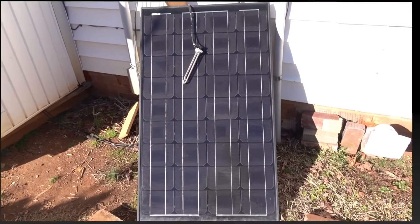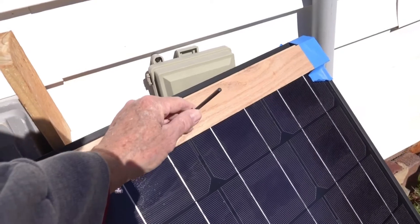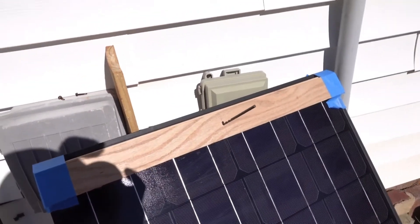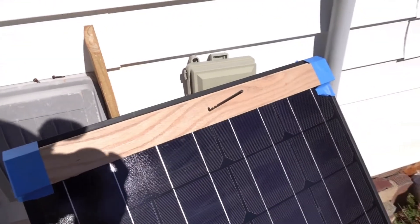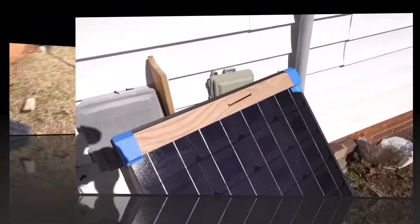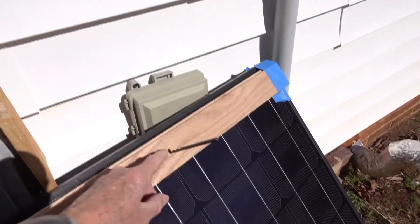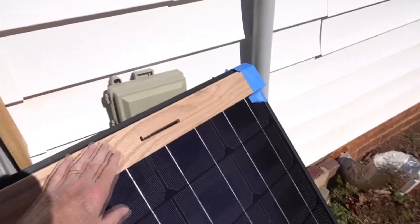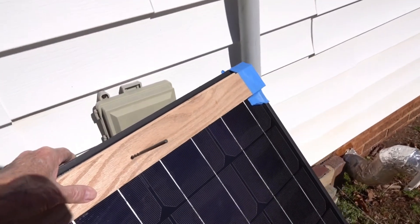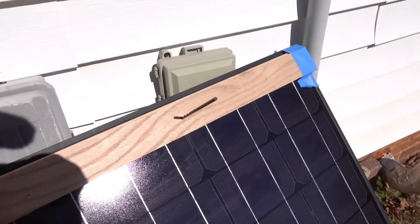I've got this board. I drilled a hole perpendicular and just left the long drill bit in it. This is how I can tell if it's oriented perpendicular to the sun. You can see it's a little bit off from the house and so forth. When you move it around you can see how the shadow changes. When you get that shadow to a minimum, it's pretty much perpendicular — where you want it.